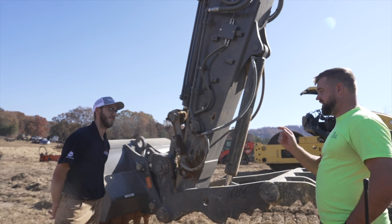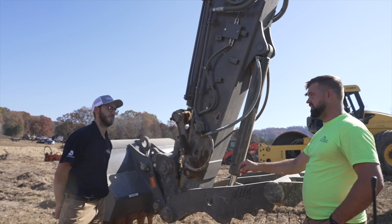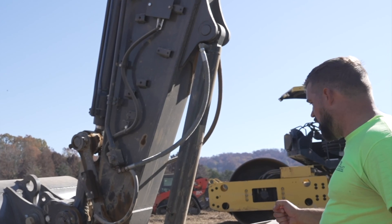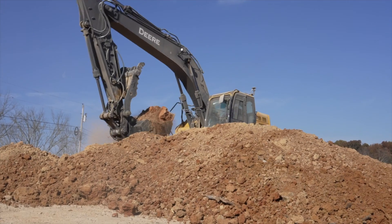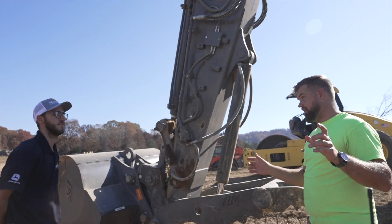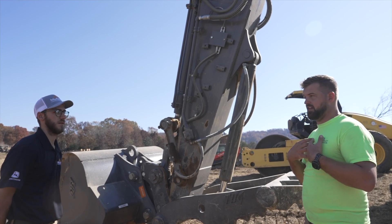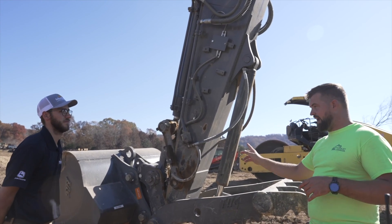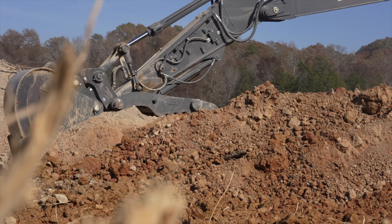It's actually not as quick as the indicate system — it lags just a hair when you're swinging. You get a lot of numbers fast and you almost have to wait back at the ground for just a second for it to compute. This is a slightly older system, and that's probably my only negative on this machine. The 245P has a really fast cycle rate — obnoxiously quicker than a lot of other machines on swing rate. So this indicator-only system probably shows a bigger delta because the machine is also faster. As an operator with a lot of seat time on GPS, when I come back to the ground I'm looking for that quick zero-zero indication, and I almost have to sit on the ground for a second to get it.